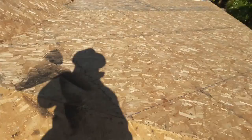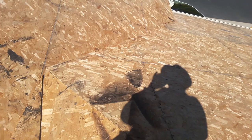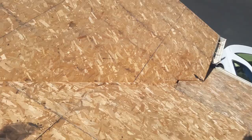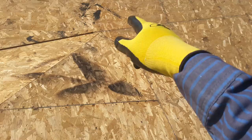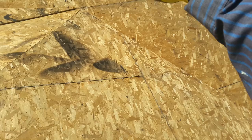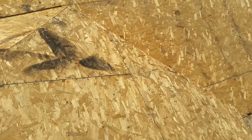Last time I saw a video of a guy on YouTube who installed the valley metal directly on the bare plywood — I think that's wrong. When you have a tile system, the valley metal, the tile, the flashings — everything is cosmetic. The real waterproofing is underneath, on top of the wood. This guy put the valley metal down, then just a half a roll of peel-and-stick on each side, and overlapped the paper only to the middle of the valley.